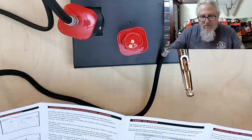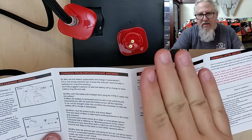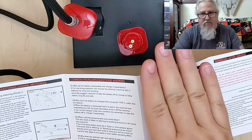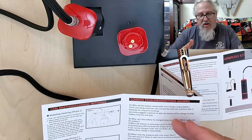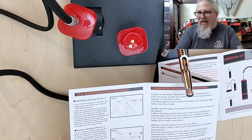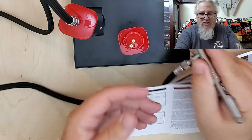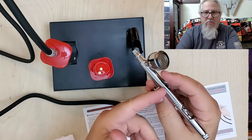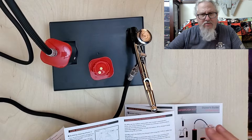The instructions do show how to dilute paint — I wouldn't bother with that because everybody's paints are different. Go with the manufacturer's instructions for diluting paint. They also cover common problems, care and maintenance. They mention bubble cleaning, but I personally don't do that because you're back-flushing paint potentially up the handle and into your air chamber mechanism past the O-ring — putting undue pressure there. I simply would not do that. I've been airbrushing for a long time, so don't do that.